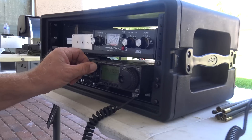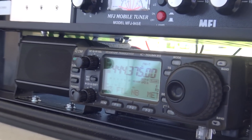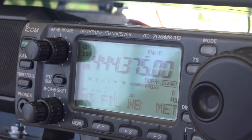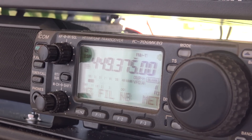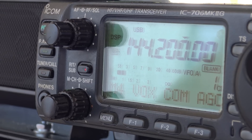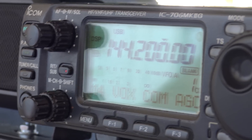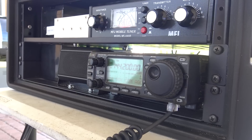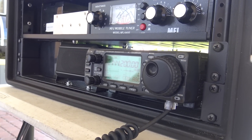The amateur way without an analyzer — we're on FM just to use the meter on the radio to check SWR. The SWR on the FM portion is just flat. SWR is flat across both bands. There's no tuner involved — straight to the radio. Right, you don't have a tuner for VHF.